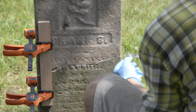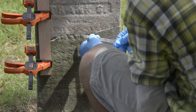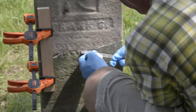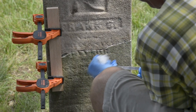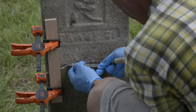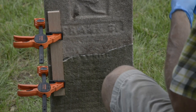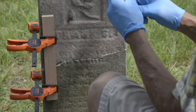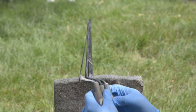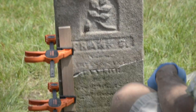That tool is a tuck pointer, which is about the most standard masonry tool. These come in all different sizes — the smallest is three-sixteenths of an inch, the most common is three-eighths, and they go up to larger sizes like seven-eighths. Would a putty knife work? No — it could remove the excess, but not to do what I'm going to do now. These are what you use to put mortar between bricks or masonry, but they have many applications.